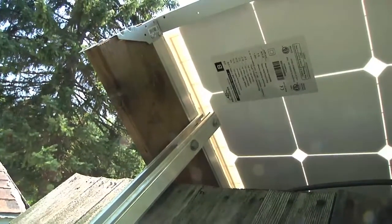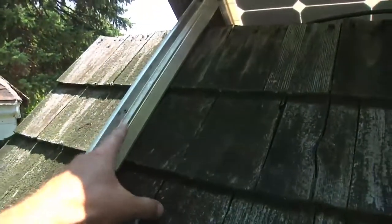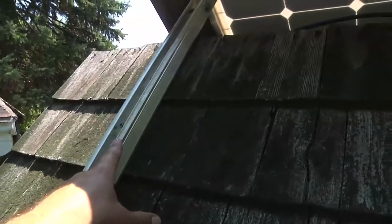Then up there I drilled a hole so I've got a cross bolt going through and into that aluminum frame that I bolted on to the photovoltaic panel. Unfortunately the roof supports are every so many inches and that doesn't line up with one, so what I'm going to do is add another roof support underneath the roof.